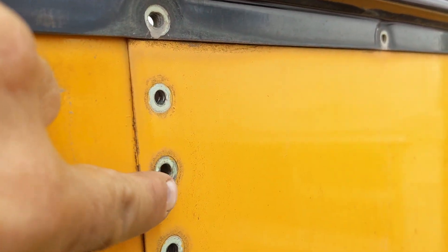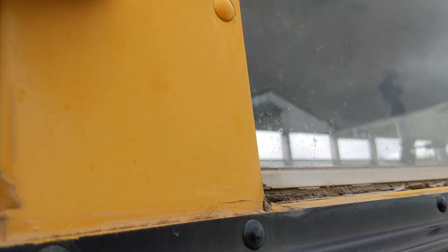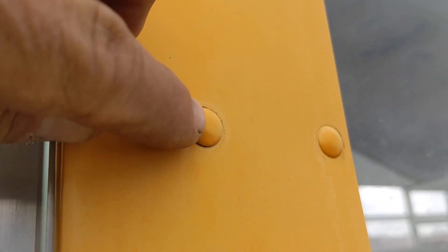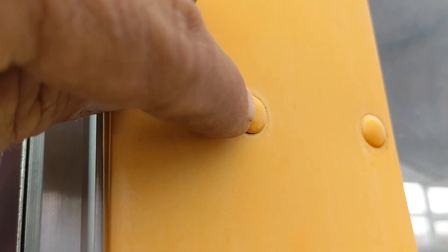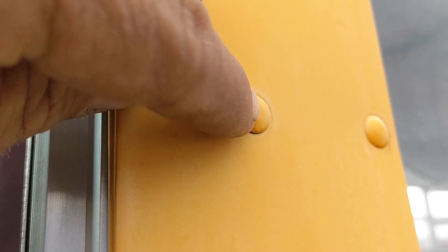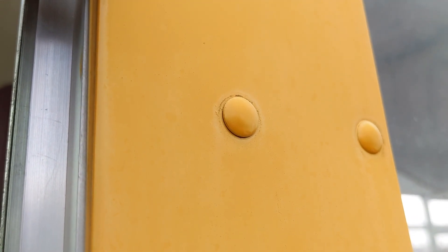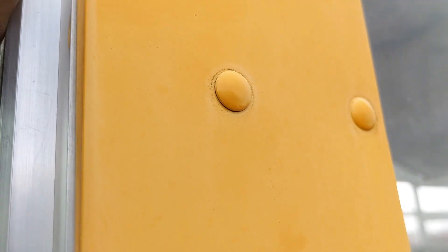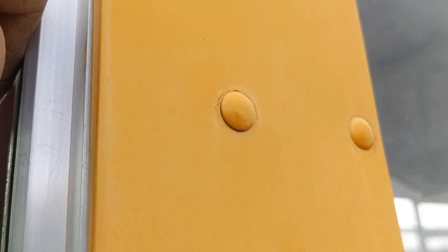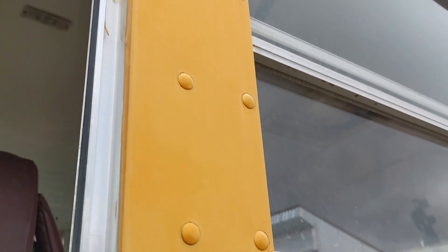But what if you need to protect the surface? If you had to take these rivets out but couldn't get to the inside and didn't want to mar the skin, the best method is to use a center punch and punch a good starter mark in the center of the head, then drill into that with a quarter-inch drill bit. Eventually the head will start spinning on the bit and then you can push the shaft and body of the rivet through without marring up the skin. In this case though, I'm just going to grind them off and peel the skin away.